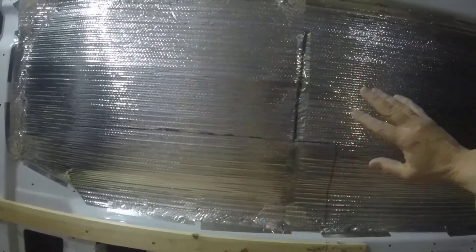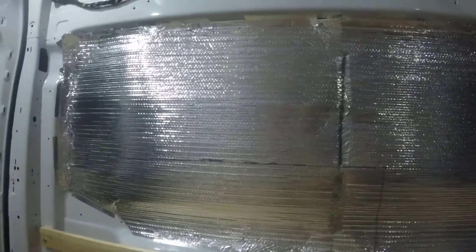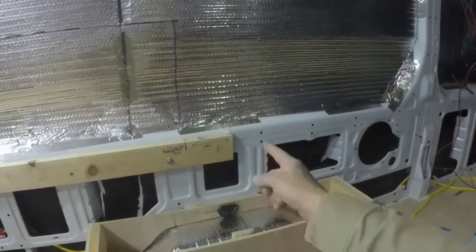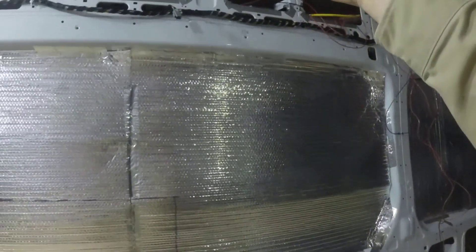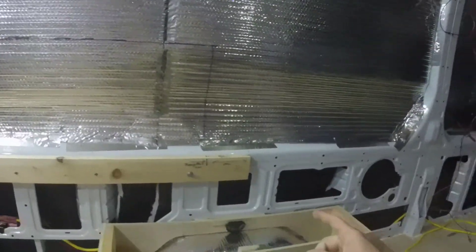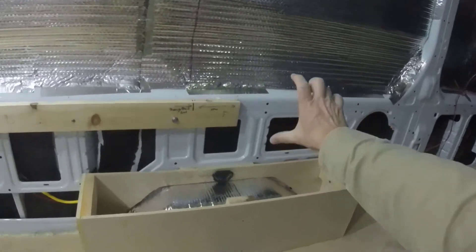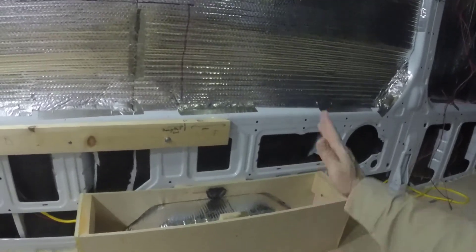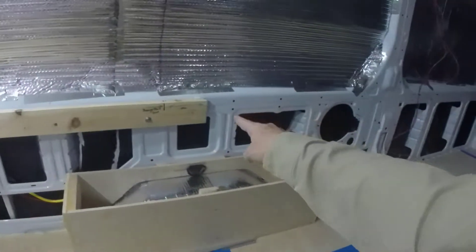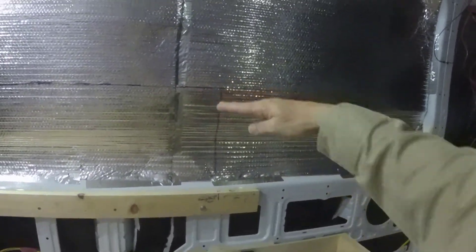If I have a stud going up, some plywood across, something coming down that side, then frame behind it maybe an inch and a half all the way across and put material behind that — bring it down behind the bench and connect it into the back of the bench — I get a nice inset. Whether we put art on that wall, an etching, a wood burning, or a mountain scene, we haven't decided yet. I'm trying to figure out whether to do a single two-by-four here, and the reason it comes out there is that's the second step — I don't want that board end flexing too much when someone steps up. There'll be a drawer coming out this way as step one, then you hoist up to the platform.